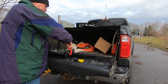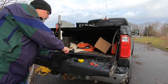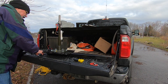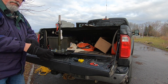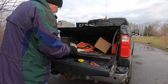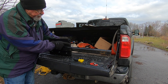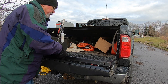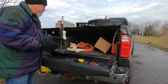I've got a C-clamp which allows me to attach grounding wires and other things to the base, and I've got some quick bolts here which we're just going to remove. Having the quick bolts off simply allows me to tilt the antenna over so I can assemble it while it's on the truck. This is two-inch square tubing that attaches onto the Reese hitch, and at the bottom I've welded a couple of angle plates with a hinge. It's a simple mount — I haven't even had a chance to paint the inside of it yet.